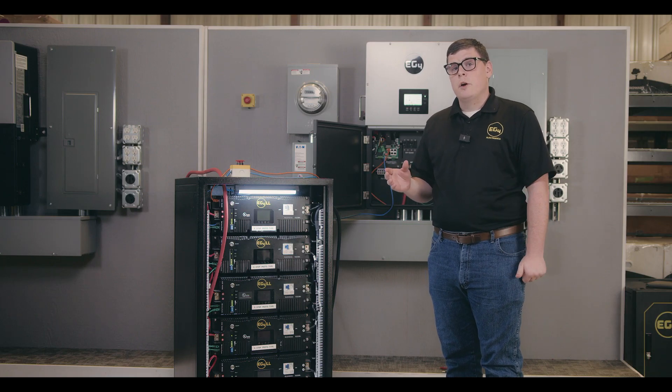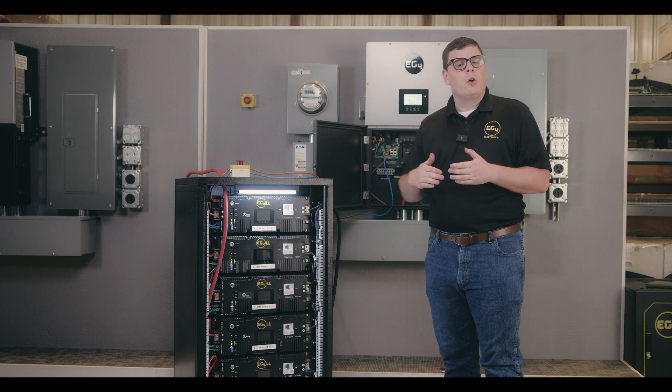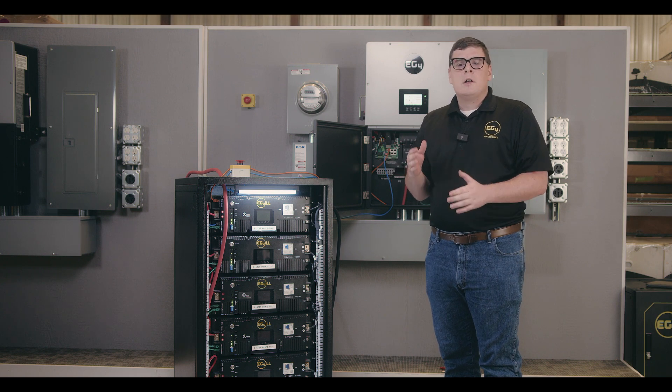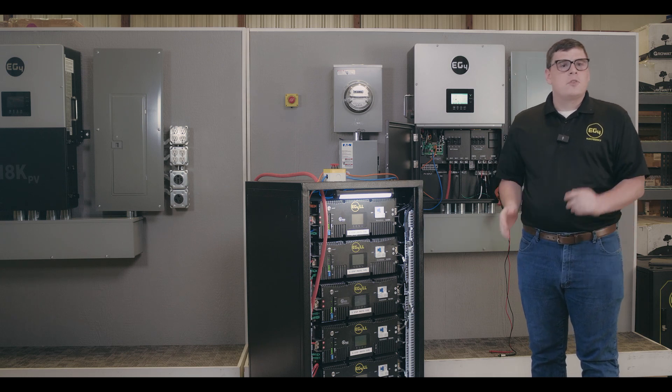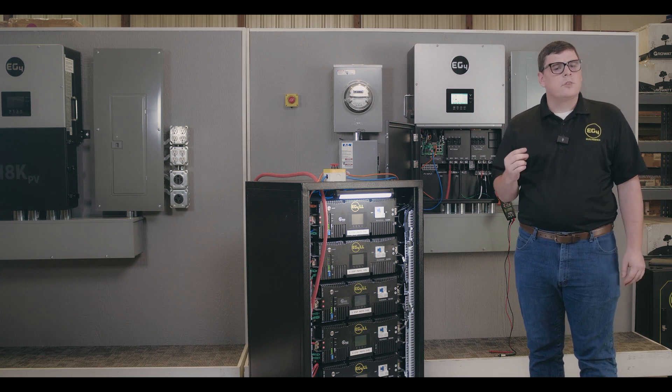Many provisions in the National Electrical Code seem to be heading in that direction, and we've seen some of the larger-scale battery systems have serious requests for a real, true rapid shutdown capacity on the system and a way to also de-energize the batteries. This is important for firefighting and any kind of emergency management situation when you're building a system.